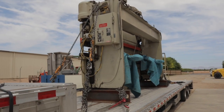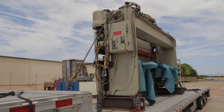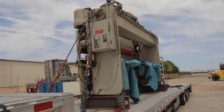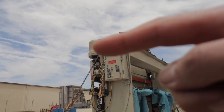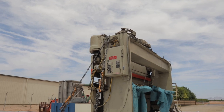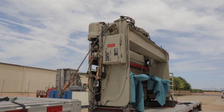On this machine there were only two actual tie-down points, right up here. There's one there and one on the other side, so I had to improvise. I was able to run the chains through there by taking the cotter pins out of the hooks, removing the hooks, and running the chains through. Luckily I was able to fit two through there.